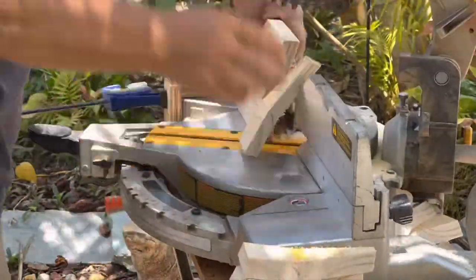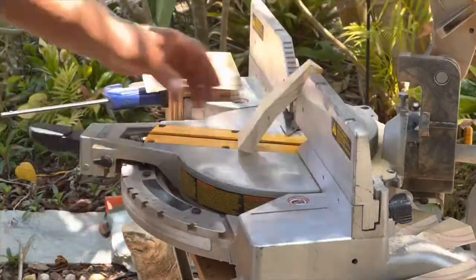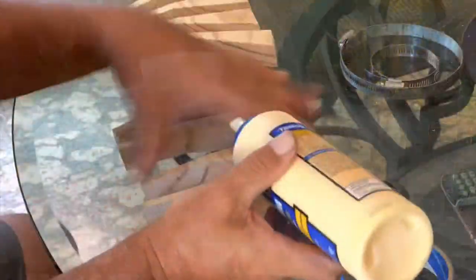Since the compound board can't be reversed to make the same cut, only every other cut will go together to create the splayed miter bowl or vase pieces. If you match the length of your cuts, the two different shaped pieces will fit together as you will see.